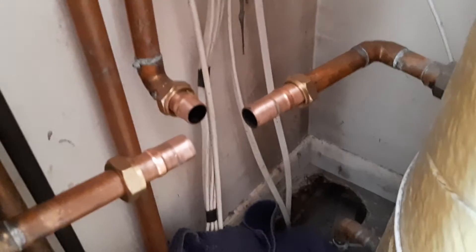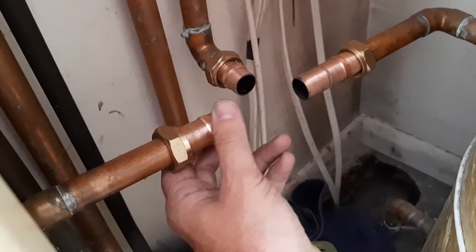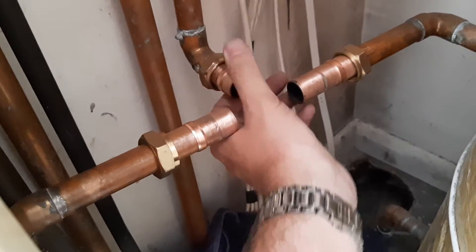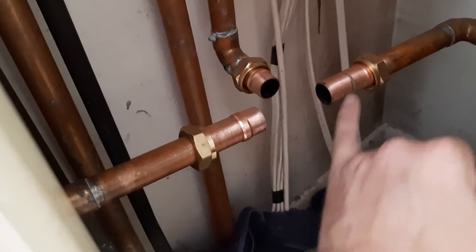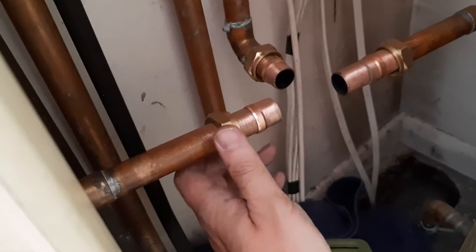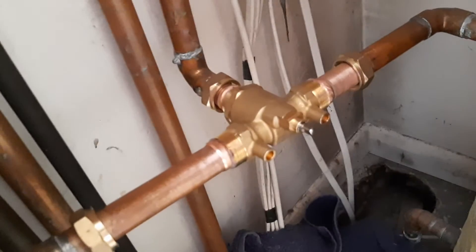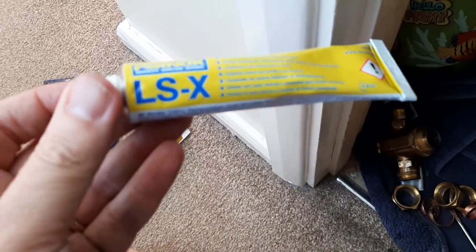I've cut off the old compression washers and put the fresh ones on. I've cleaned everything up and sanded it down so the new washers sit nicely. Don't forget to put the nuts on as well. I learned a tip a while ago to put some silicone sealant on the shoulder of each fitting, but I don't have any at the moment so I've nipped out to get some. I've now smothered the compression fittings in Fernox LSX jointing compound, which has a consistency like clear silicone — probably silicone-based. Just got to tighten it all up and hope it doesn't leak.